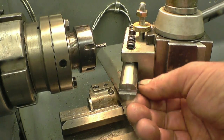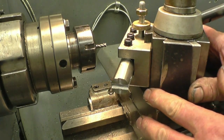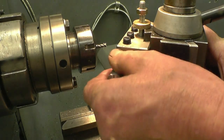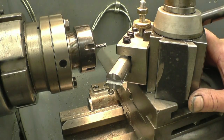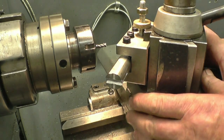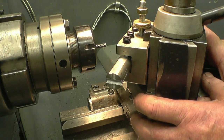Once I've machined that flat on it I'll put a little keyway in it. It's unlimited what you can actually do on the lathe if you put enough time, effort, and thought into it. If you haven't got a milling machine, a simple angle block is better than nothing, but a vertical slide is obviously more rigid. For model making and small stuff, it's been used for decades and it works remarkably well.